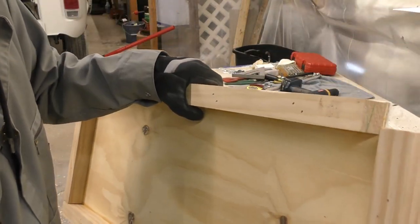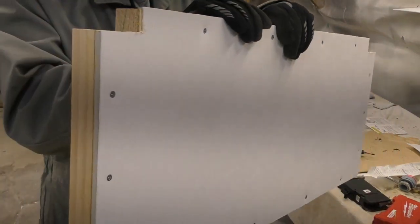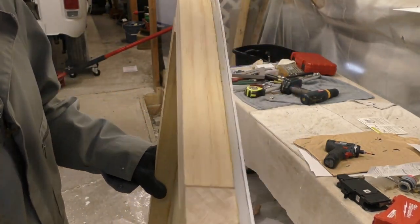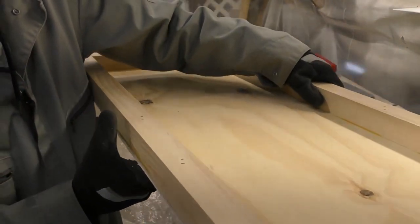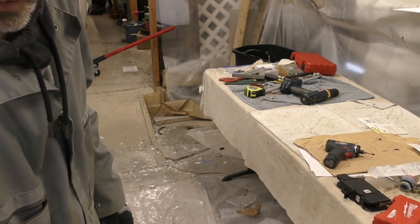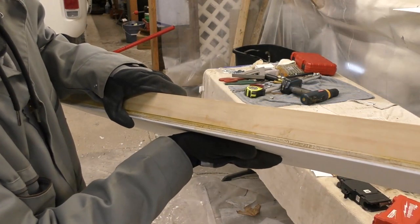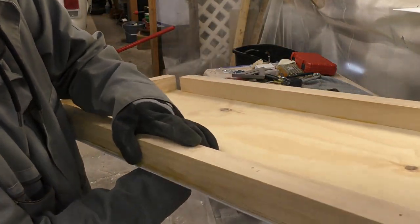Then I did a dry fit and made sure it fit, and I noticed that in the rear part I had to cut these notches out — see these notches here — because the rails on the upper part of the rear would get in the way. So I cut those out and then I have these four pieces of 2x2 pine. Quarter inch plywood especially after gluing will not be completely straight — you really need to go to three-quarter inch to even get a flat piece, but quarter inch is much harder to find anything flat.